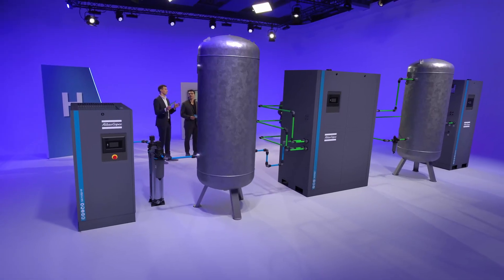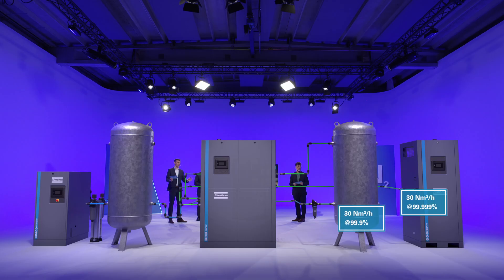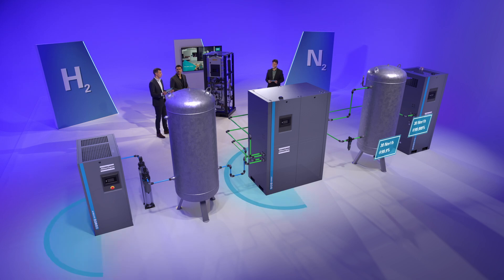In a system with the NPH, as you can see here, both the compressor and the generator are sized smaller because we can produce nitrogen of lower purity, which requires less feed air, which then again saves on energy costs and allows for smaller machines. That all adds up to a very compact footprint that will please customers who do not have a lot of space.